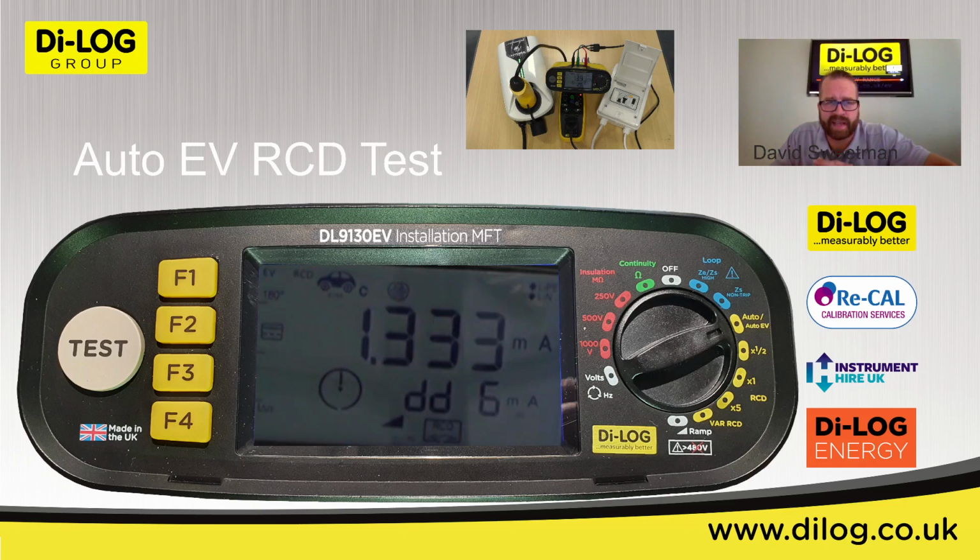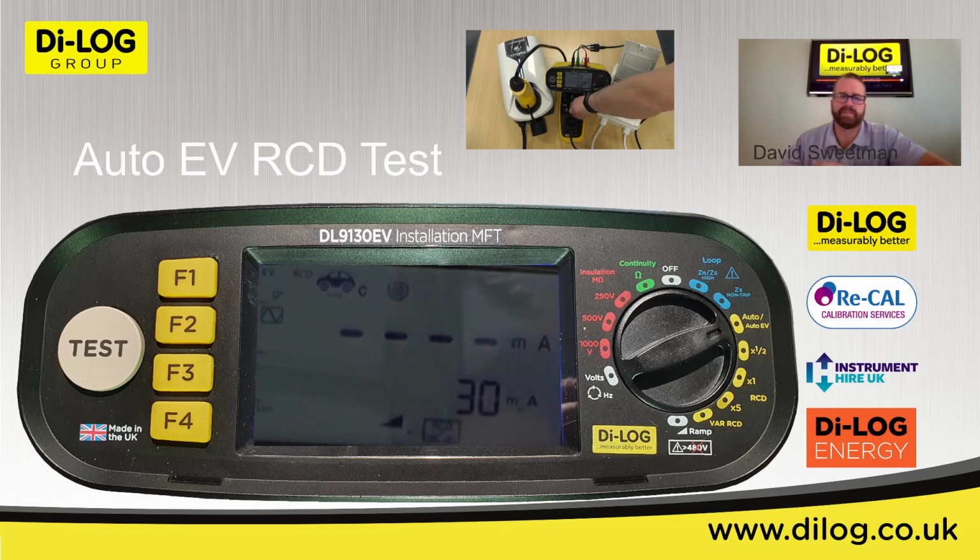And as you can see, it does count. It does take a while to count up because it does need a little bit of time to actually engage the ramp test. There you go, so it's done the 6 milliamp side ramp test, and now we're just going to simulate 30 milliamp ramp test as well, so 21 milliamps on there.